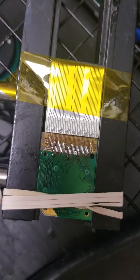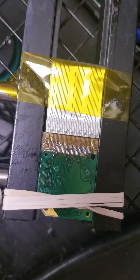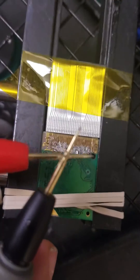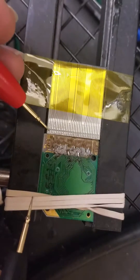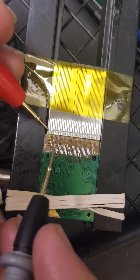Now we're going to magnify back out and shut off my soldering iron so it doesn't get burnt. Then we're going to take the multimeter on continuity or diode test, tap them together, and make sure we got continuity.